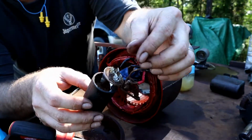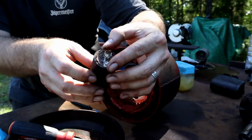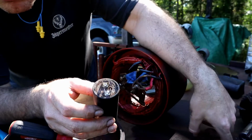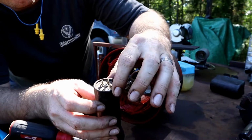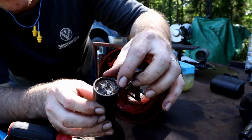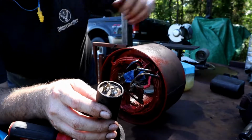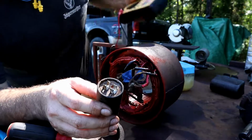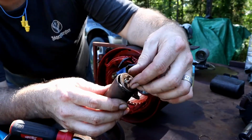And it had this little stopper and had this pressed down into there like that. I was testing it for capacitance and I didn't get any reading, so it was open. It was an open circuit where it should be closed with some amount of resistance, and the resistance should start somewhere and then drop eventually to nothing, or thereabouts. So after I figured out that that wasn't happening with the ohm meter here set to resistance, I went ahead and popped this little keeper off, and since I'm working outside, I should be fine.